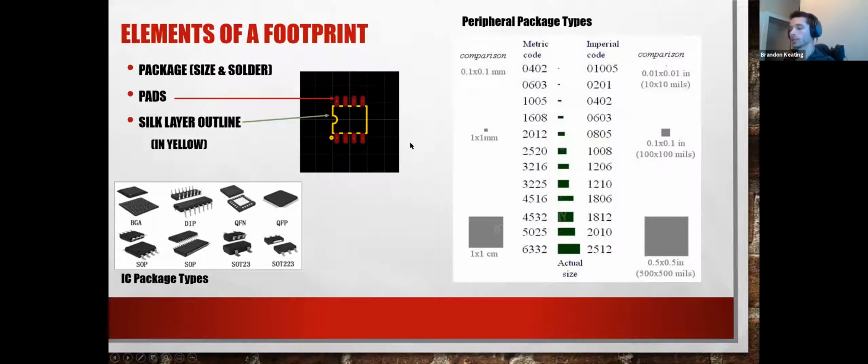That said, for the very small oscillating board that I showed earlier, you wouldn't need any of that. You can go 0402, completely tiny components, just again, to make it very small. So on this, we can use 0603 because we don't have a huge component density, but on a Raspberry Pi or something like that, you're going to see a lot of 0402 components, which are, I mean, barely visible.